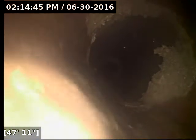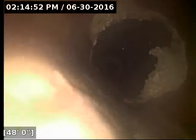And we got stuff like this going on. What this looks like to me is we've got dirt and stuff that's pouring in from the outside of the pipe. It's possible it's excess pipe grout, that's kind of hard to say. This looks like you just got a lot of dirt and stuff and possibly roots trying to push their way through the outside of the joint.